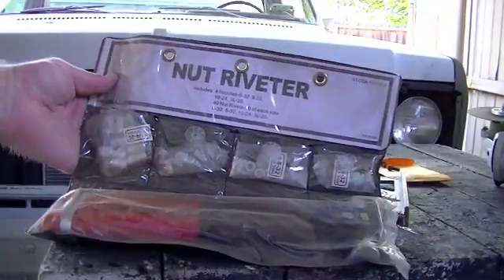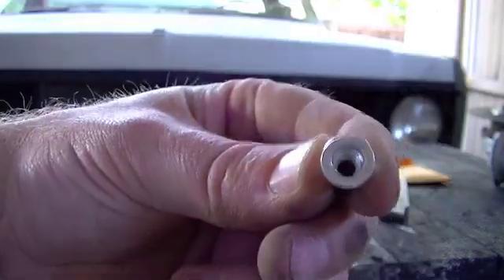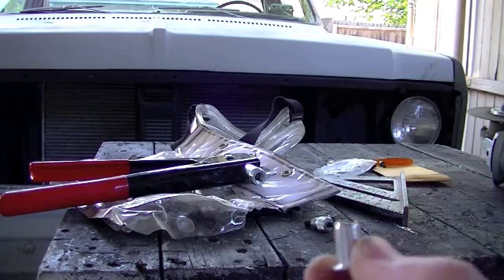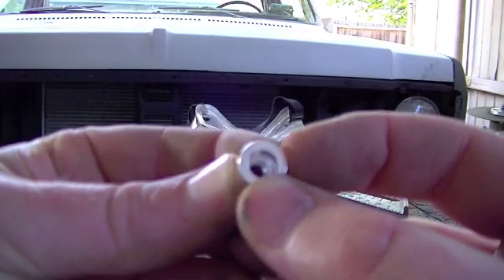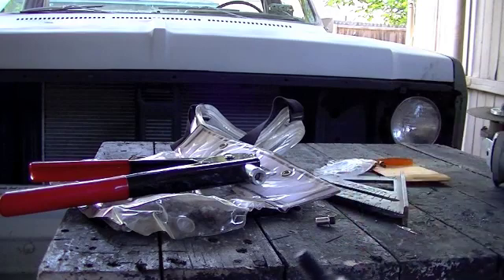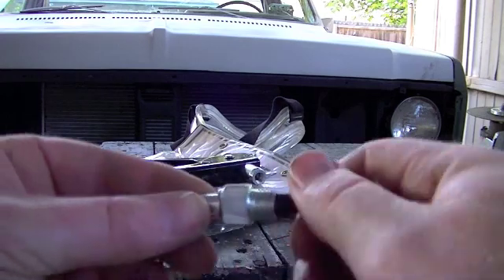Here's a little nut riveting tool that I was telling you about. I'll open it up and show you how it works. This is a riv nut — you can see in there that there are some threads. It's almost just like a rivet. This one's about 1/2 inch long. There you can see the threads, but up here towards the top there's an area where there are no threads. What this does is, as you pinch it down, there's a little tool that you put in there, which I believe is this tool right here.